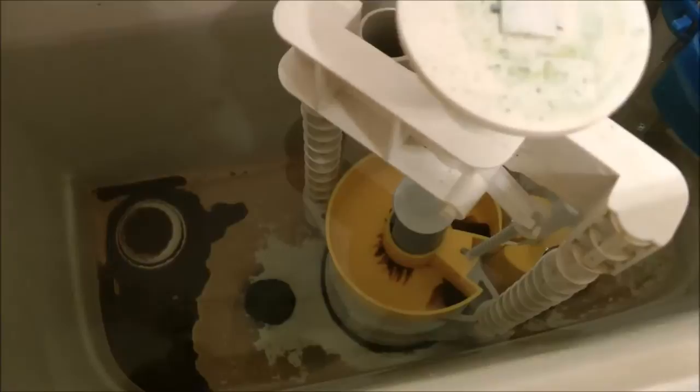If it's a little bit of silicone, you might be able to get around that, but if it's quite a lot, it's a problem, because you cannot replace this flushing mechanism unless you remove the cistern. Underneath here is where you need to get in, because the water flushes into this little area and then into the toilet. I do apologize for the dirt there, it's just water, trust me. They typically silicone it here, as you can see. They siliconed underneath and to the wall. So the fact that it's not screwed means that you are stuck.